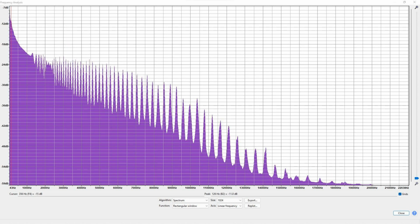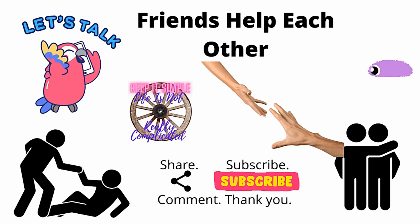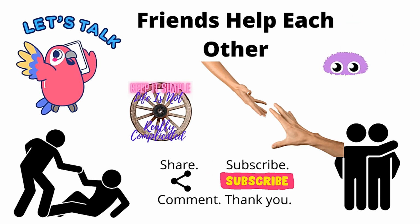So bearing that in mind, this shouldn't be too much of a surprise. It's got to drop off at about 15 kilohertz. However, the minus 20 goes sailing on to about 18 kilohertz and a bit, and then it's still got some output at 20 kilohertz. So what that means is this is a very good tape, and if you don't drive it too hard, you're going to get excellent results from it, really good.